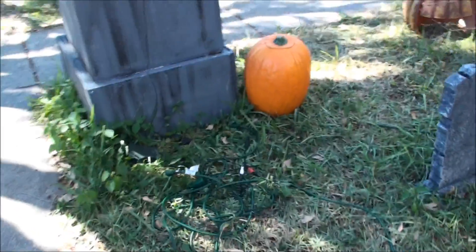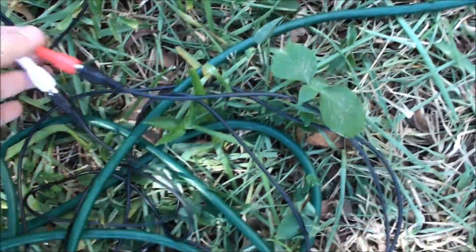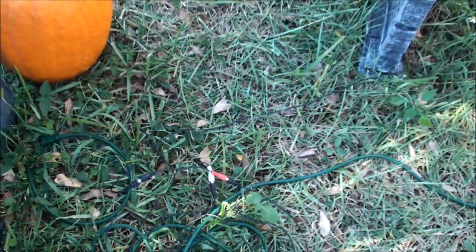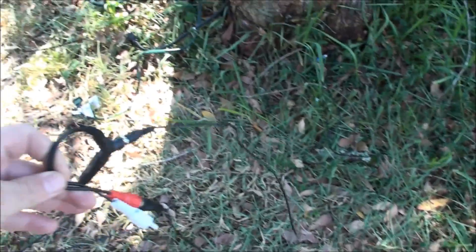The original point I was making is that this setup is nice because whenever I made a run somewhere and decided I wanted two LEDs in that area, instead of running another huge long cable run I could just throw another Y adapter on it out in the grass and then have two connectors — and I could keep doing that as many times as needed. That's because each LED has the resistor soldered directly onto the LED itself, so I don't have to worry about resistance out in the field.